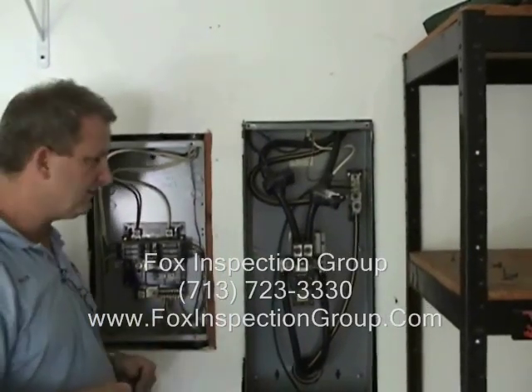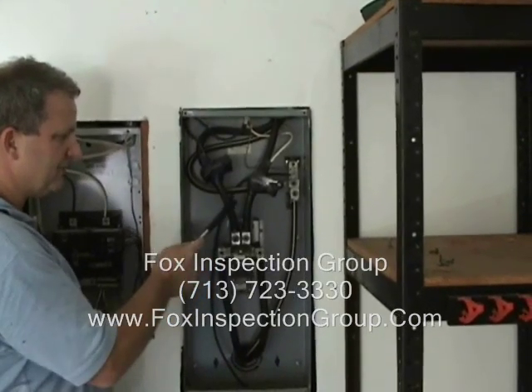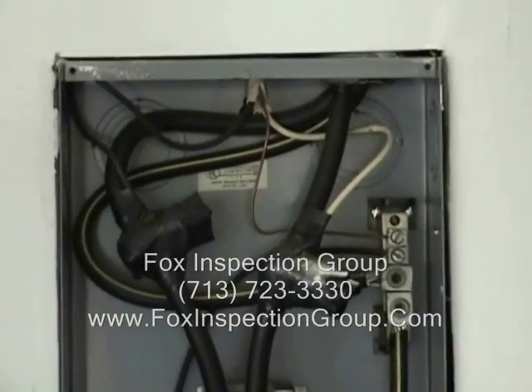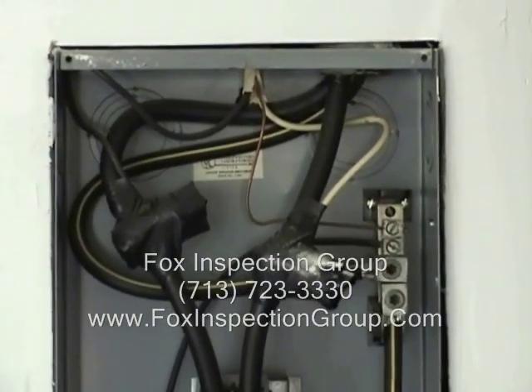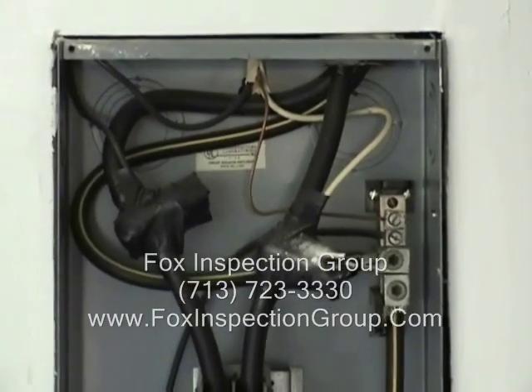We really can't determine that definitively. In essence, what we have is the potential for 200 amps of current going through 10 gauge American wire gauge copper. It can't support that kind of current. If you had something drawing that much on the back side, you can overheat these wires and potentially cause a fire.